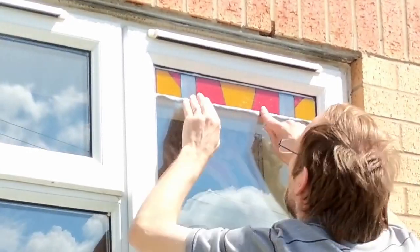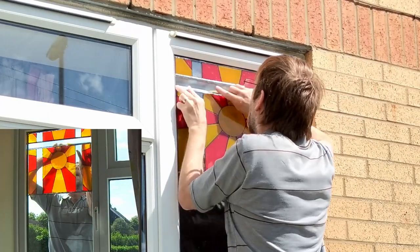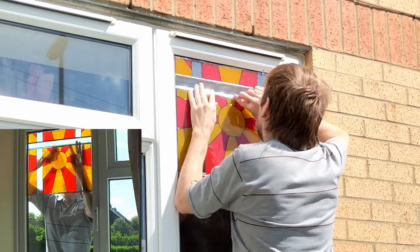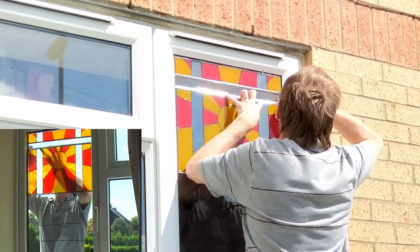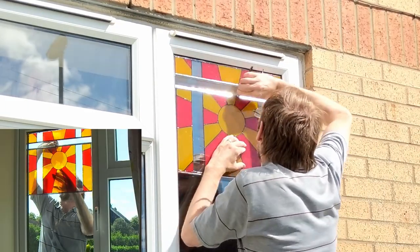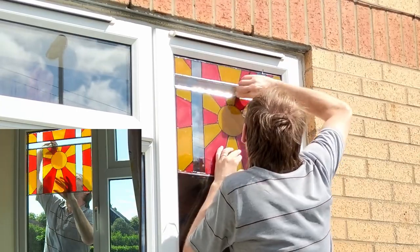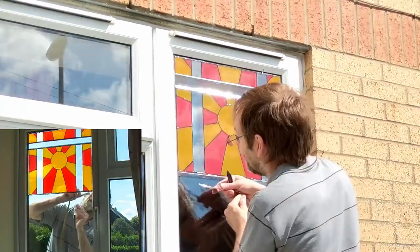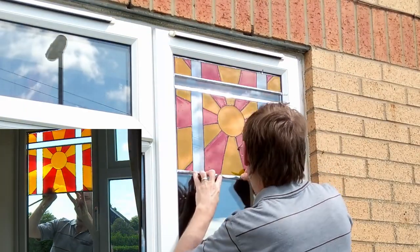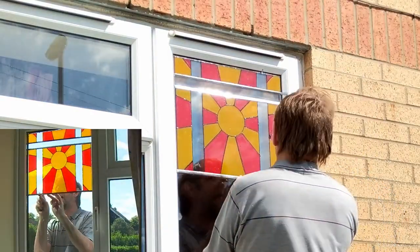After that it was time to do the large panel — the second one down. It's a much larger panel but I did it exactly the same way: measured down using the panel, put my 4.5 millimeter piece of lead across, and that gave the place for it to fit. This time I could put it both top and bottom, so I've got the two horizontal pieces of lead going — one across the top and one across the bottom. All the time I'm smoothing this down.